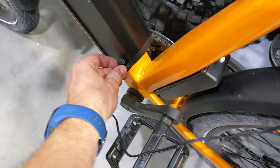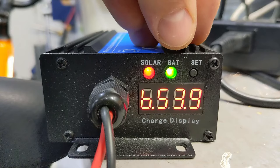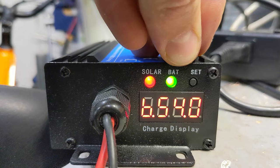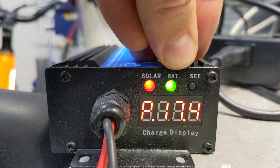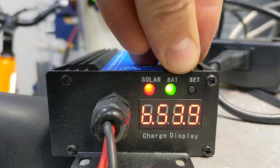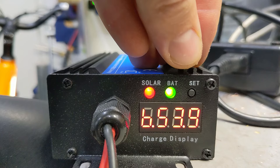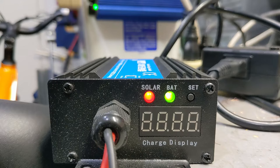Here's what the screen means: this is the voltage of the battery right now, 53.9. This is how much the solar panels are putting out, 19.1. This is the current going through. It takes a couple of seconds to catch up — you'll see the voltage on the panels dropping, the current going up, and the voltage on the battery going up. The panels are reading around 15 to 15.4 volts — these are 12-volt panels. The battery is at 53.9 and it's going to charge until it reaches 54.6, then it will stop.